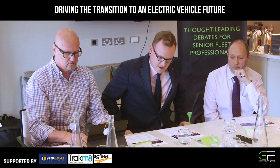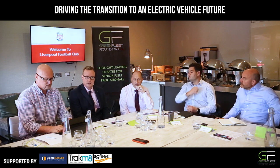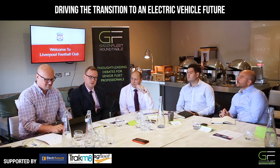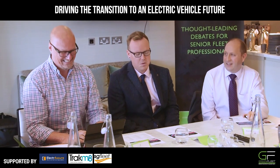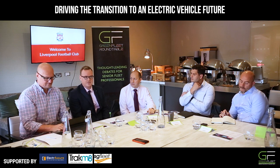I did a survey a little while ago. He was a great delight telling me that he installed 80 charging points in his car park. When he took me, I said, where are they? He said, oh, there they are. There was 15 three-pin sockets. He said why not? I opened the flat and he said, you see that discoloration? Because it's not rated to take that amount of current for that amount of time.